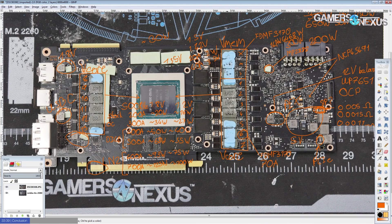This is a very solid PCB from NVIDIA and it's going to be really hard for add-in board partners to make a much better one. For extreme overclocking I'd value the addition of a third 8-pin power connector, which I think some cards might be doing. But overall you get a really solid vCore VRM, massive overkill on the memory VRM, and the new 12-volt balancing. There's not much to improve on here — this is a really, really solid card.